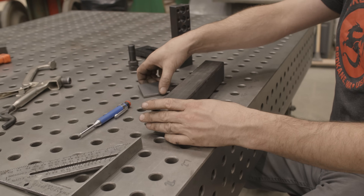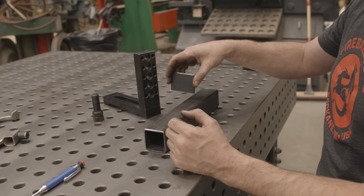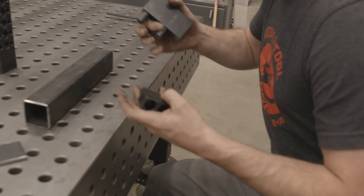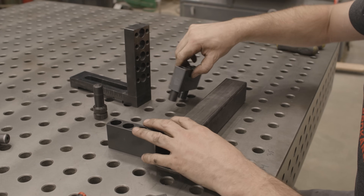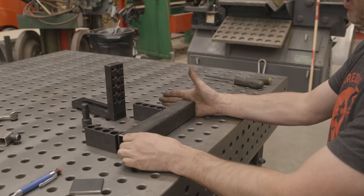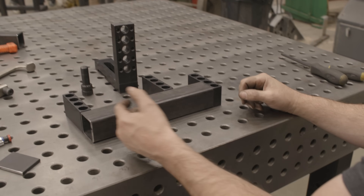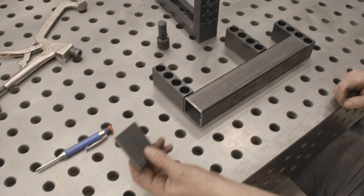So here's how I would set up this scenario — I don't have any measurements but we can randomly guess and I'll show you how to give ourselves options to adjust. First thing I would do is locate this tube using tools. This is a fence block and I would locate it first, give myself a little bit of room here at the edge of the table, and lock this thing in place — so now I can't push backwards. The next thing I need to do is make an end stop, so I'm going to use a fence block again, drop him in there — boom — and now I can bump the tube into this corner. Now this tube is located in the right spot.